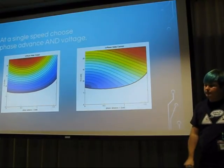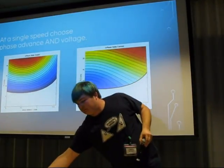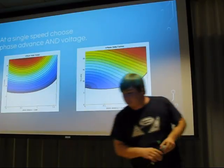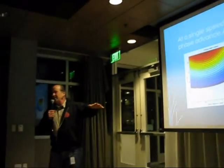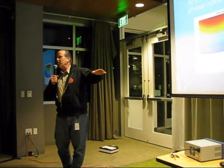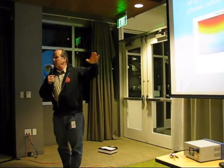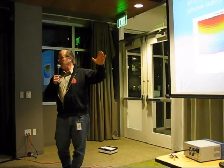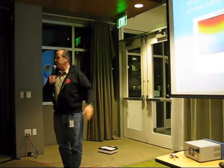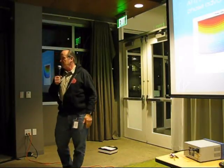Conceptually, remember I described this open loop, making sure the phase was in the right place while you're not looking. But if you're running at a certain speed and you're running at 90 degrees, maybe there's something sophisticated going on where you've got to run them a few degrees earlier. And I don't need to understand what all that sophistication or what the exact angle is. I just need some way of implementing it, and with this processor, of course, we can, according to what the experts tell us, or we can do it experimentally and find out what the right phase advance is. So it's an extra little twiddle on that plus or minus 90.